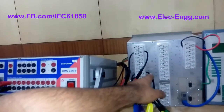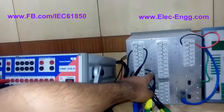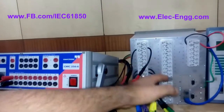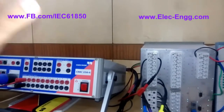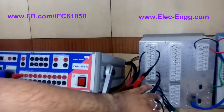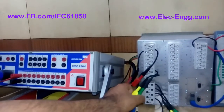Here are the voltage terminals: three-phase voltage V1, V2, V3, and VN. We should connect them to terminals R15, R17, R18, and R16 respectively. You should check the manual and do the wiring based on the diagram assignment, because for each relay it is different.